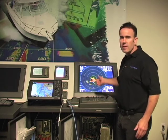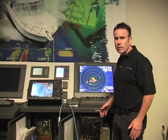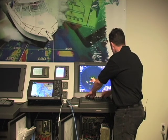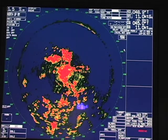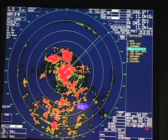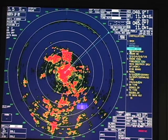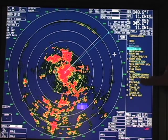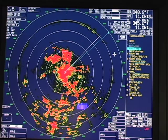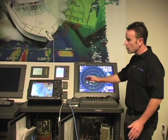The installation menu is accessed on the X7 series radar by holding down the heading line off button and pressing menu five times. Once you do that, it enables the installation mode. I'm going to click on Installation. It's very important that you have item number seven — the type set to C mode, which is the non-IMO mode — and that'll make sure that it works correctly with the NavNet 3D. That's one thing you'll definitely want to check.